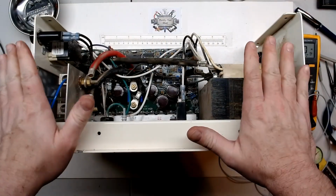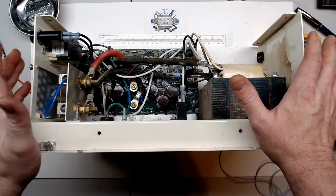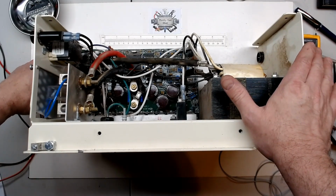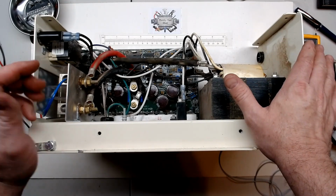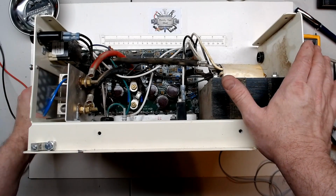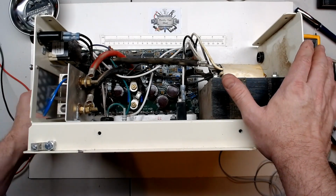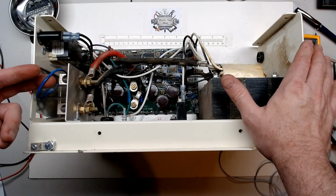So the power up part of that test actually went very, very well. I was not expecting to come across something that simple because that switch is hardly ever touched. It's only switched back and forth through a relay here out in the field when it's installed in the service truck. But some corrosion had got that switch, which apparently it still goes through that main switch. It has to be on in order for this to cut it on, which makes sense.